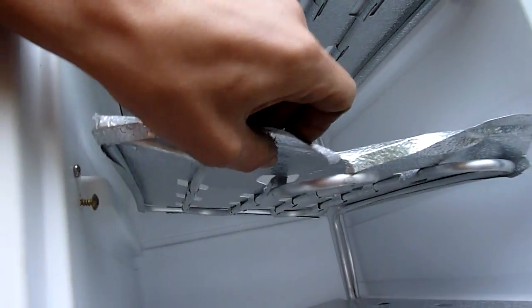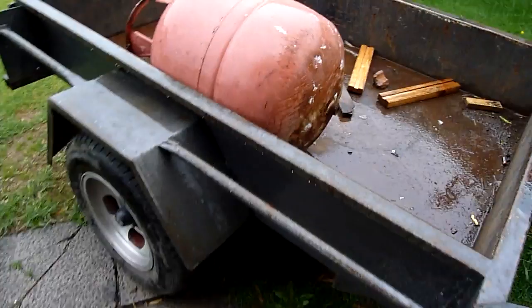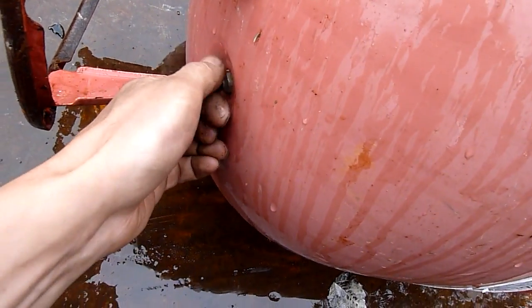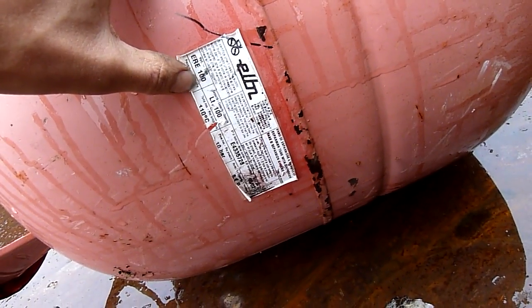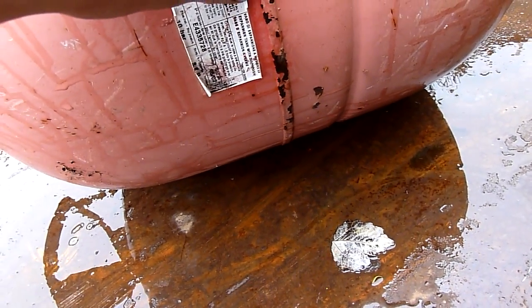Alloy sheet — if anyone was wondering why they're so easy to crush, it's because it's just piss-weak aluminium pressings. Hopefully I can turn that into a vacuum accumulator — connect it up with a ball valve, pull a full vacuum on this and then open the valve. But it's still got a bladder in there which is under pressure, so I'm going to have to vac that down first. This is a water pump level accumulator — I've got to vac that bladder down, crush it down, and then use the volume inside. 100 litres, max temp 110 degrees, maximum pressure 10 bar — expansion tank with diaphragm. Should be interesting.